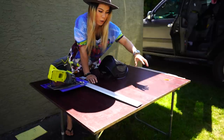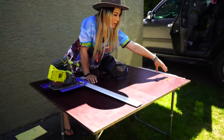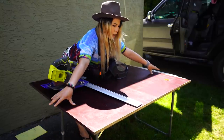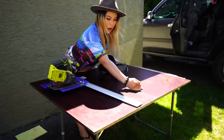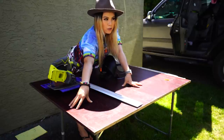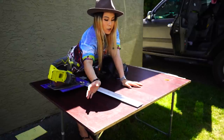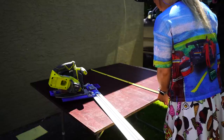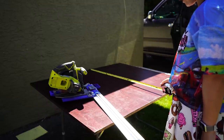I'm going to be using an old tabletop — basically a 5/8 inch board. The width is about the same as what I was going to use — 47 inches — and I'll need to cut it to a length of 30 inches. Maybe I'll split it in half so that in the future, if I want to put one seat up, I can still manage to have half a shelf and half a seat. It measures 38 and a half, so to get 30 I'll need to cut 8 and a half inches off.